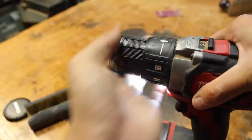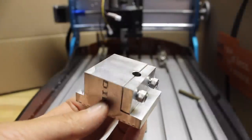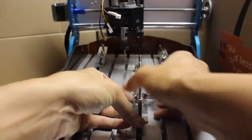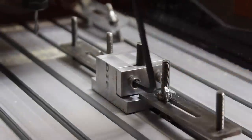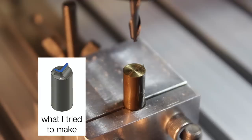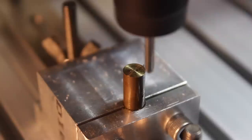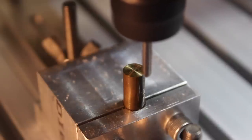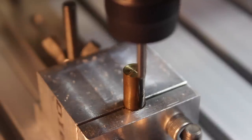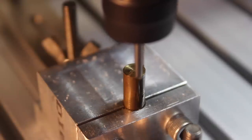Instead of remaking the part immediately, I went down a long rabbit hole to see if I could make some brands that I could mount in a soldering iron and burn the missing circles and check marks into the existing part. I have a soldering iron that takes quarter inch diameter inserts and I happen to have some brass dowel. So I made this holder in my Bridgeport mill and crossed my fingers that turning down the feeds and speeds would still make it possible to cut. Unfortunately it did not. I tried five or six times and they all ended the same way, with the machine stopping almost immediately after the tool makes contact.